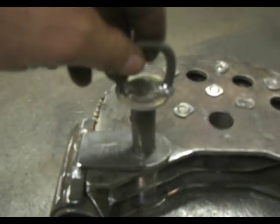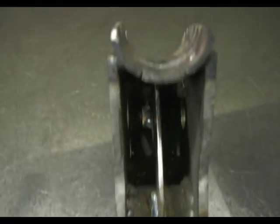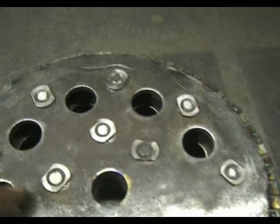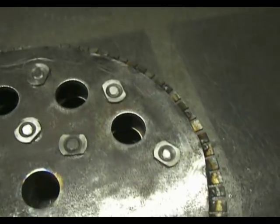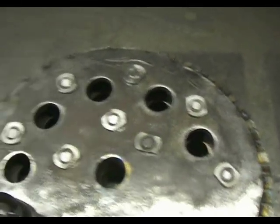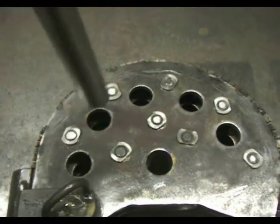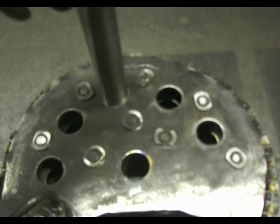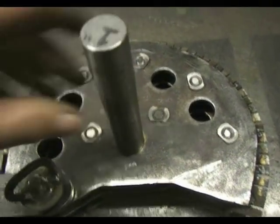As you can see there's the tube in place and the locking pin goes in there just to hold it all in place. I won't weld these wee nuts just now simply because that will allow me to tweak it if I see it starting to flex or anything, and when I'm sure everything's okay I'll weld in a couple of wee tacks along the edges. These holes are basically to move the inch pin along when grabbing the lever at different positions to get the full 180 degrees, and it's got the inch pivoting pin there as well in the centre.